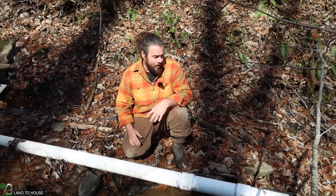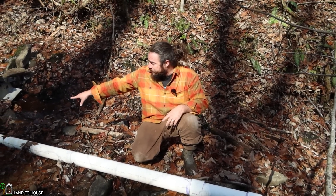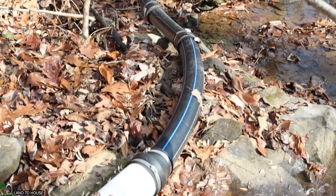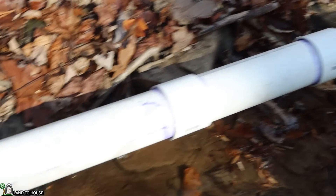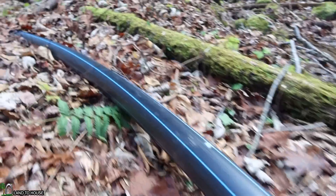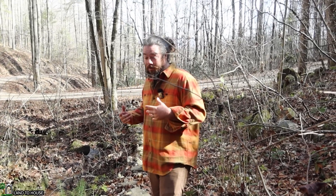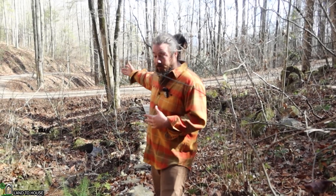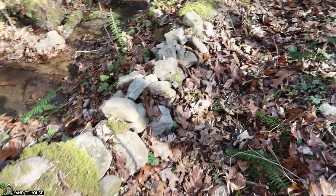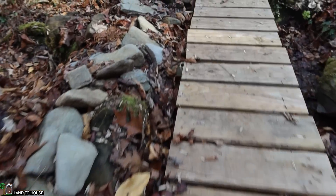I have multiple fittings along the entirety of my penstock. I start out of the Coanda screen with a 6-inch to 4-inch coupling to a PVC, and then I use the Fernco couplings at the top. A lot of folks think the pipe is unsightly — I am one of them. So where you can see it from my driveway, I made this little rock Irish knee wall with moss and everything to cover up the pipe, and it provides a bit of insulation too during freezing temperatures.